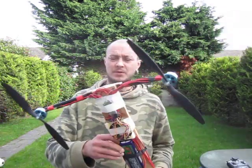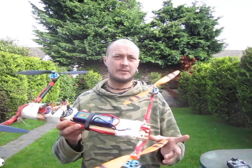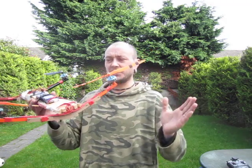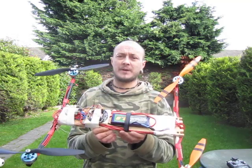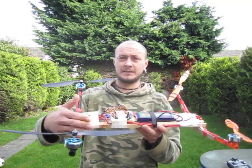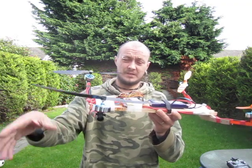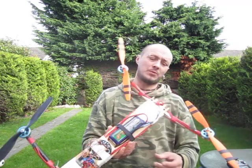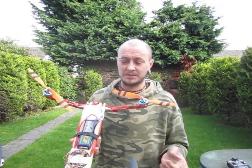Hello, this is me and my motor tilting testing again. I like the tilted motors because it increases stability and it flies like a glider in a V-shape. It's all good on X-frame quads because the tilt doesn't affect yaw — yaw turns only from torque. But when I tilted on my little H-quad, I had problems.